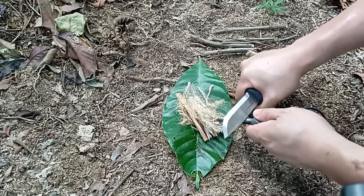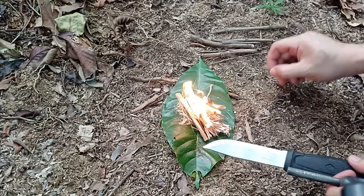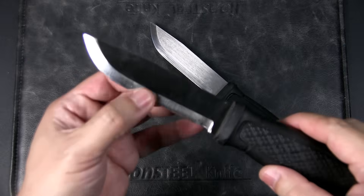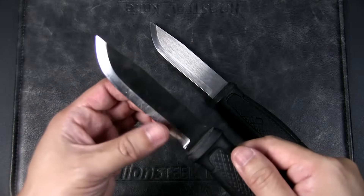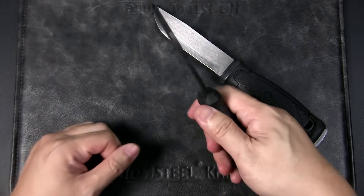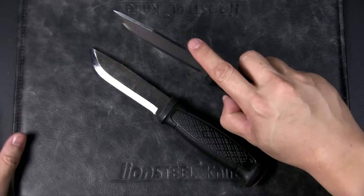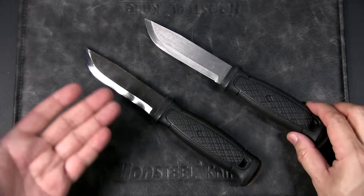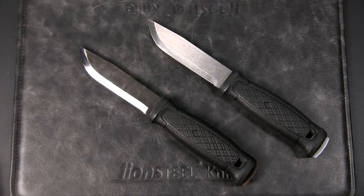You might be thinking: if 14C28N seems like an all-round superior steel, why would people use the carbon steel? I'm not sure personally — besides being tougher and harder, the stainless is also corrosion resistant. As you can see, the carbon steel has a bit of rust forming even with a coating and a mirror finish polish on the Scandi blade, even though we dry and clean the knife. The only real reason to choose the carbon is maybe if you want to strike flint, since the stainless version does have that 90-degree spine for ferro rod. Other than that, personally I don't know why someone would choose carbon over stainless.